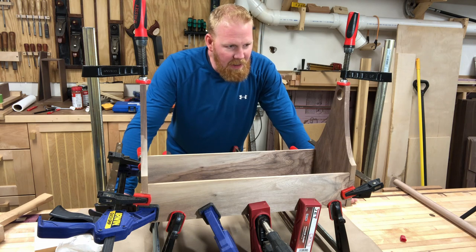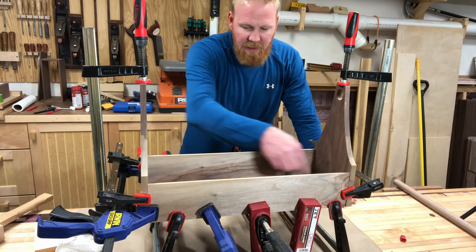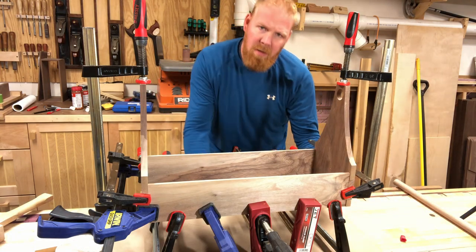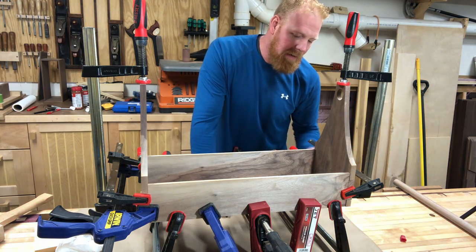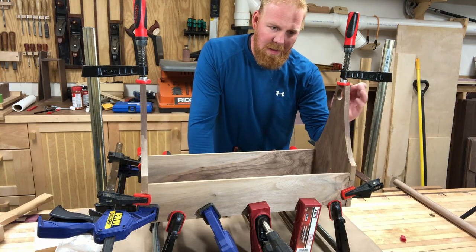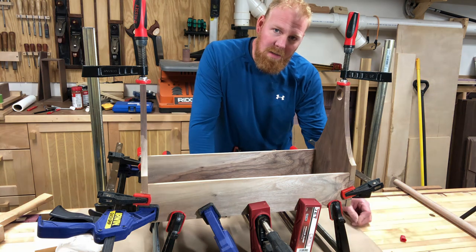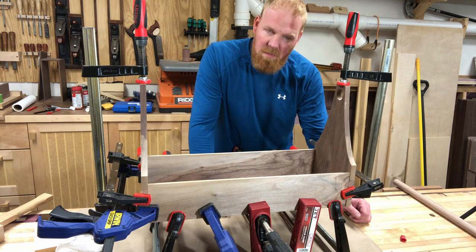And then only a couple parts remain, that being we're going to install a divider down the center here. We're going to put additional security on the bottom piece, although we probably don't need it because the edge gluing is certainly enough. However, we're going to put some dowels in there. We'll dowel in the center divider, and then we will install the handle, and I need to come up with a creative solution to secure the handle in the workpiece. So nearly there. See you next time.